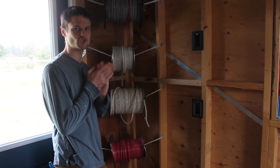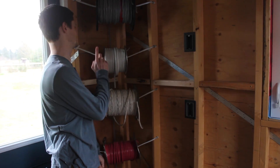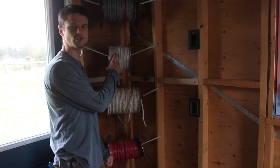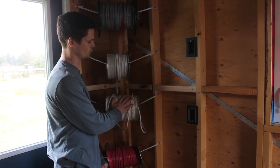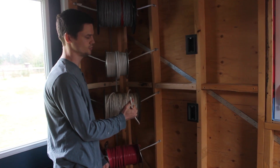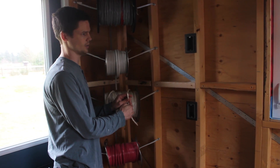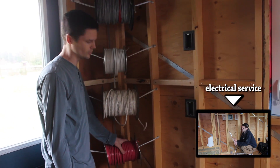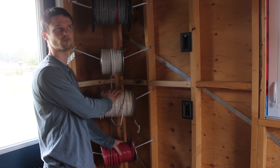I'm using a little trade trick with the reels here because I don't have a rack on site and I've got too many reels for a rack anyway. I just stapled in some scraps of wire to hold up all the different reels so I can pull whatever I need at will. What we've got here is 14 gauge 2-conductor, which is general purpose for regular plugs and stuff. Then there's 14 gauge 3-conductor, which we're using mostly to pull two general purpose circuits at once — we can do that because we have both legs of the system with the 240 volt panel. And then 12 gauge 2-conductor, which is good for 20 amp circuits as opposed to the 15 amps that the 14 gauge is good for.